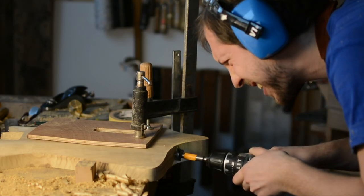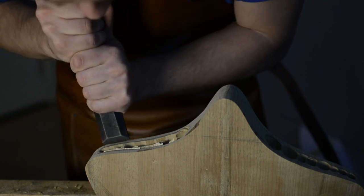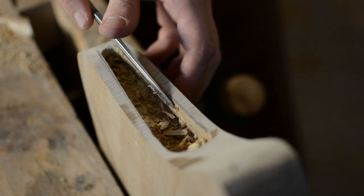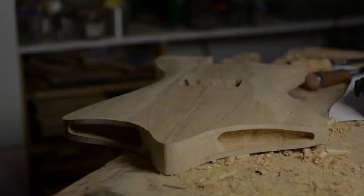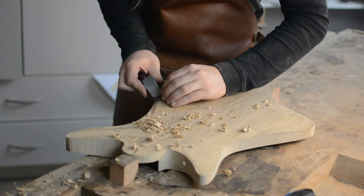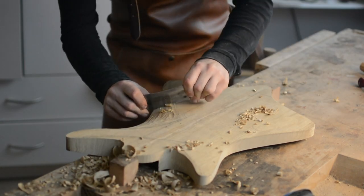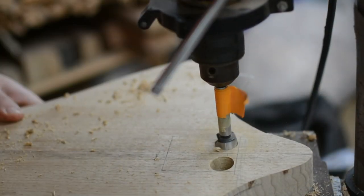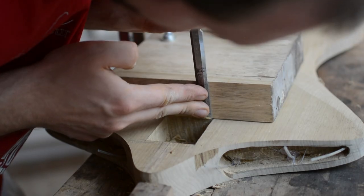The next cavities are carved by hand, just removing most of the wood with a drill and then with a chisel carving the cavity. Those cavities will receive LEDs that will light some optical fiber. I continue carving the body with a body chamfer made with the same tools. And the last cavity for the 9-volt batteries.